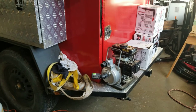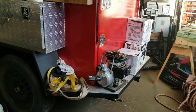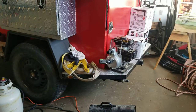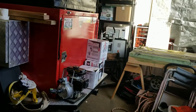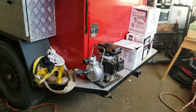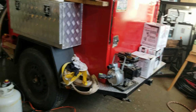The Honda equivalent produces up to around 50 PSI based on Honda's specs, and I believe it. Their inch-and-a-half model uses a GX50 engine that can turn up to maybe 4,000 to 6,000 RPM and produces even a bit more pressure. There's also a pump from Keen Engineering — they build a lot of sluice box equipment for placer gold mining — and their performance pump produces around 60 to 70 PSI.